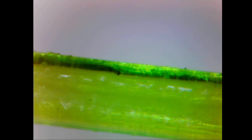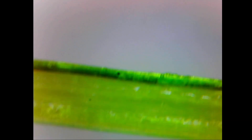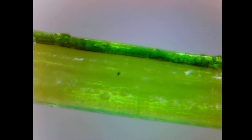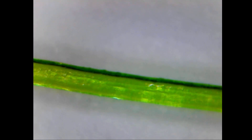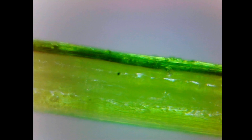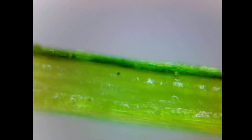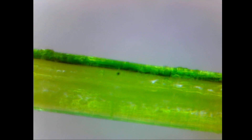Here's another interesting specimen — it's a strand of old PETG filament extruded from a 0.4 mm nozzle. The filament was stored on a shelf without any drying agents, and it was noticeably cracking and popping while printing. And indeed, you can see blobs and bubbles caused by steam exploding from the inside. It was also printing very stringy and blobby.